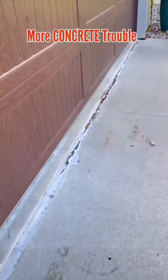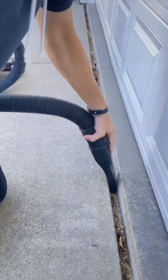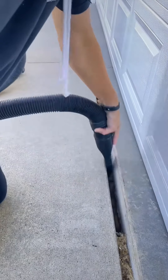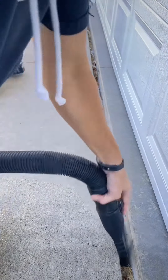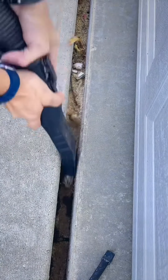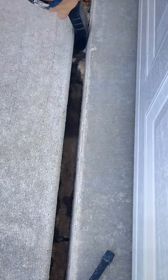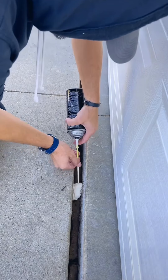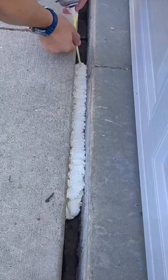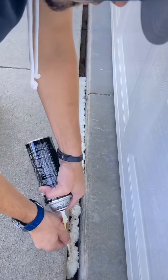Our garage and driveway concrete has separated and it needs to be sealed up before winter. The most important thing about any job like this is the prep work — you've got to have it nice and clean. The reason this task is so important before winter is because we don't want snow and ice getting underneath this concrete slab. If it does, it'll expand and contract and break the concrete, and depending on where your garage is located, you could have issues with your foundation. We have a giant void there and we can't caulk over a giant void.